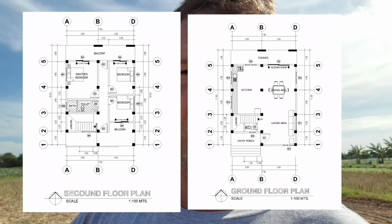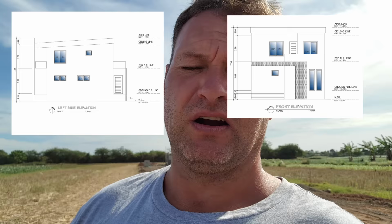Now, there's a possibility it could have happened for the fence, but we decided just to, in case they get done with this, I don't want to delay them. I want to keep stacking. I want to get that wall down because it's critical I get backfill in here and get this packed down so that it has time to sit before we start the structural components of the house, the columns, the footers, and all that good stuff.